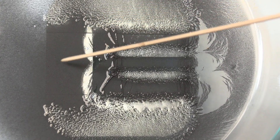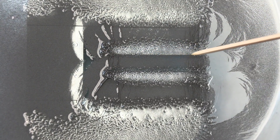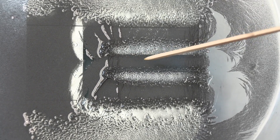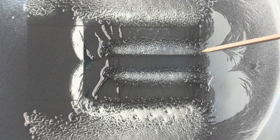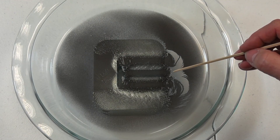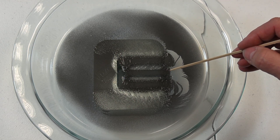You notice on the back you're seeing almost no magnetic orientation of the steel, meaning that all of the flux is staying completely contained in the steel. You see your highest concentration — it's at its most intense in this opening where we were getting the 8,000 to 10,000 gauss.